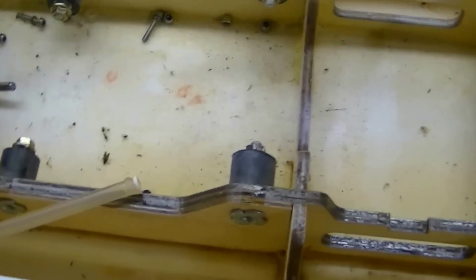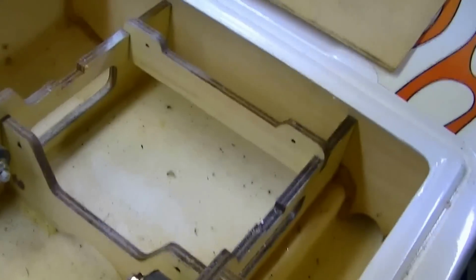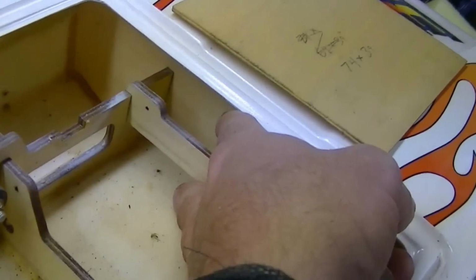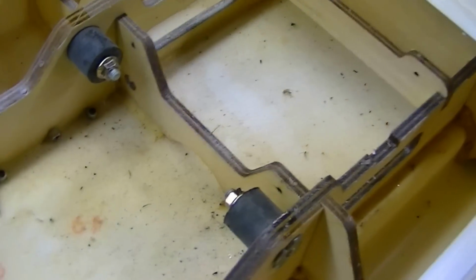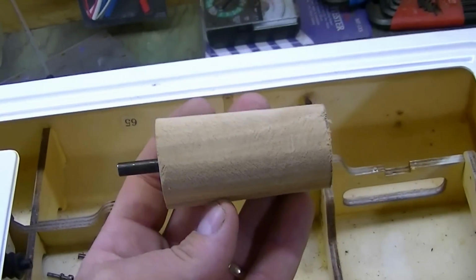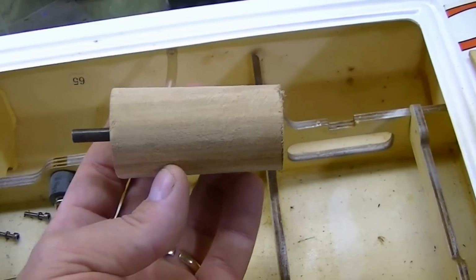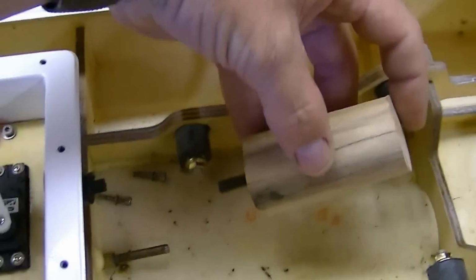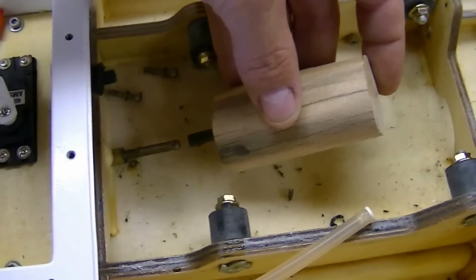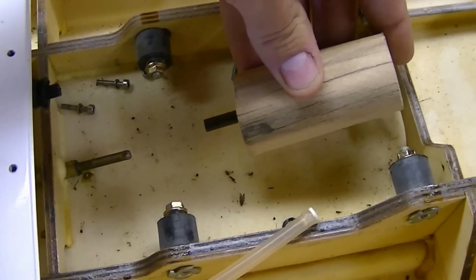Okay. So what I've done here is I've removed the engine and the muffler, but still don't know where I'm going to put the battery. Probably going to be a 5-cell stuffed right in the middle, up that way. But what I did is I made a motor mock-up, since I haven't ordered the motor yet, but it gives the dimension and the shaft and the whole ball of wax. I can see where the motor's going to go, if it's going to hit the bottom. I was afraid of it hitting the bottom and I'd have to put the motor way up here, but no.